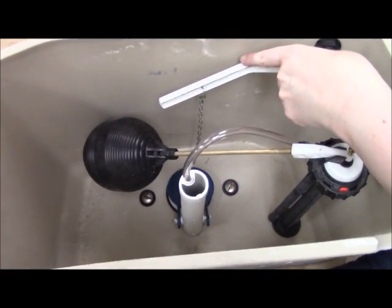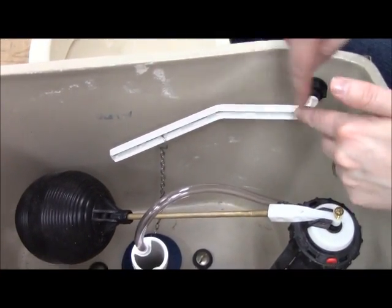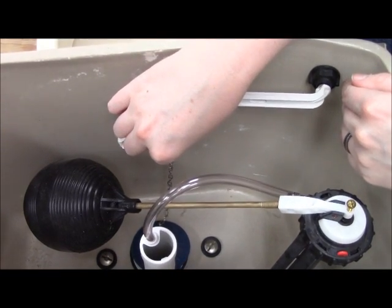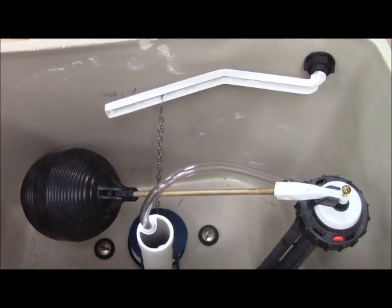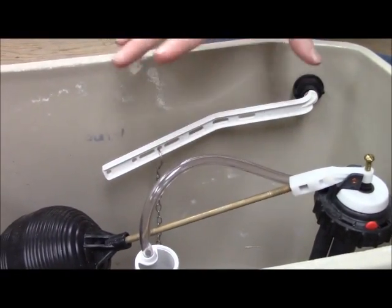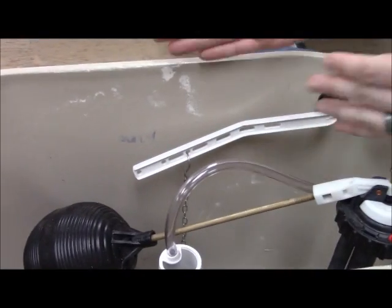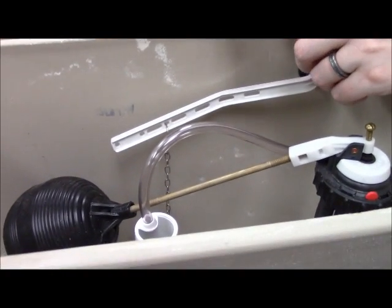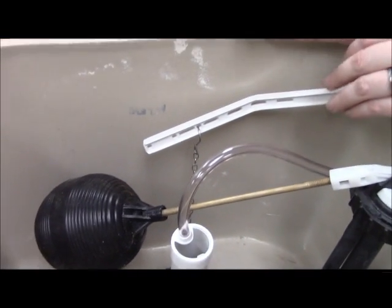The nice thing about trip levers is that they all have basically the same size hole from front to back of the tank, but the lever arm is going to be different. What really matters with trip levers is the length of the lever — you want it long enough to hook the flapper with some slack on the chain. Once the chain gets tight, it's going to pull the flapper up and you won't get a good seal. Plastic arms you can usually cut off, and brass ones you can bend if needed. Be careful though — once you've cut or bent something, most people aren't going to take it back if it's the wrong item, so figure that out before you install it.